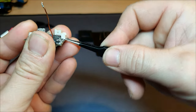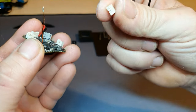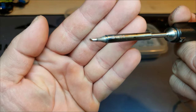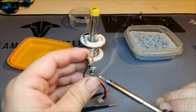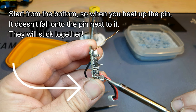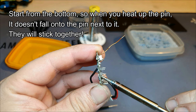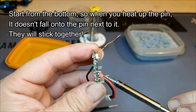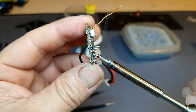Be careful with metal tools. The solder should stick to your tip. Now gently pull back and voila, one pin removed. Clean your iron, put fresh solder on the tip, and repeat till you got them all.